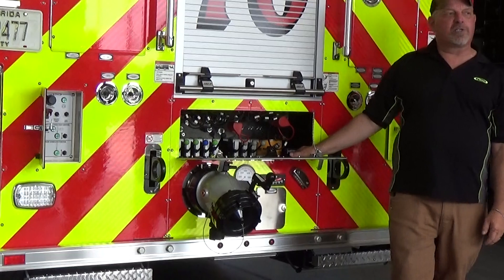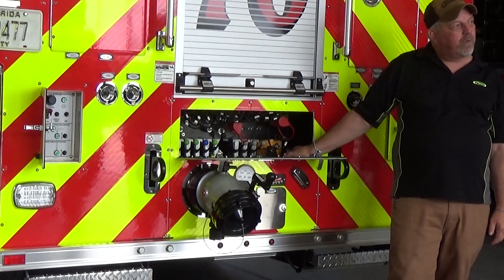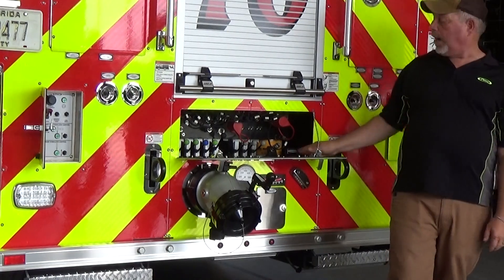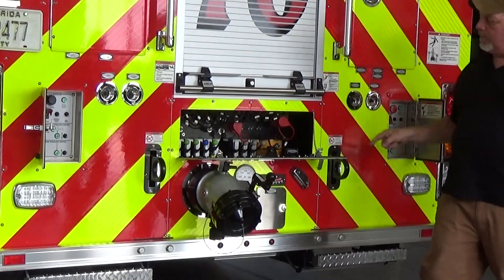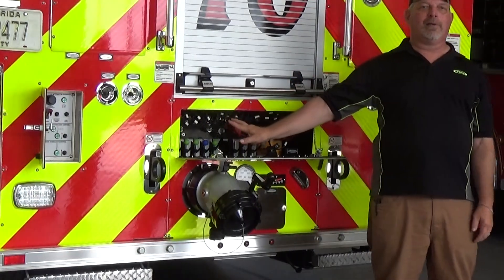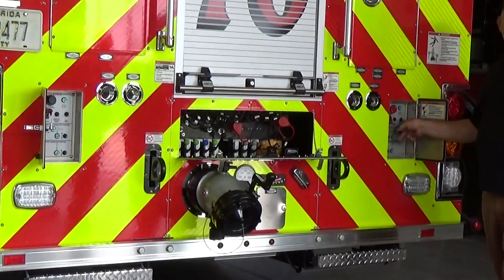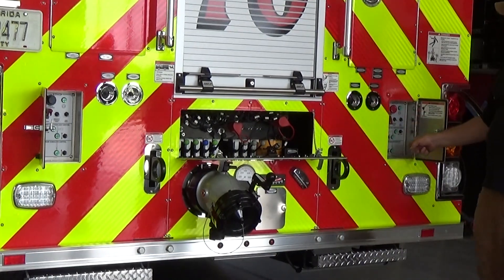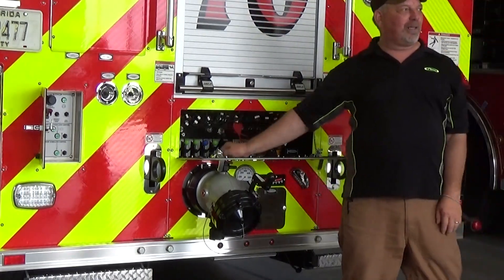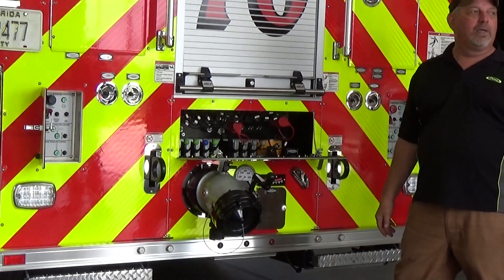This is your emergency hydraulics. When you're up there, these still move because of the electronic impulse — these valves are always moving. Even when I run the stabilizers, I run this out and that lever will move. This is just electric over hydraulic. The only difference between the two is this signal passes through the computer, and it says: if my stabilizer is on the ground, this one will not let that lever move. But if I grab the lever manually, it'll move.